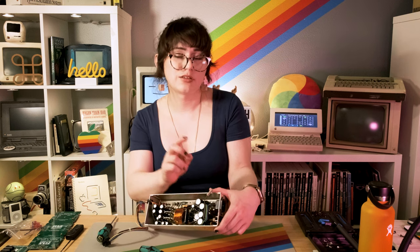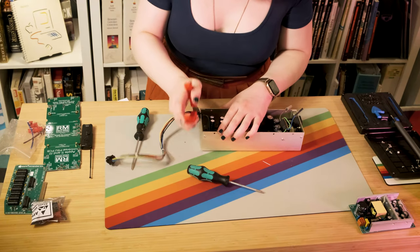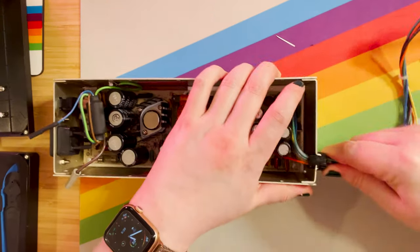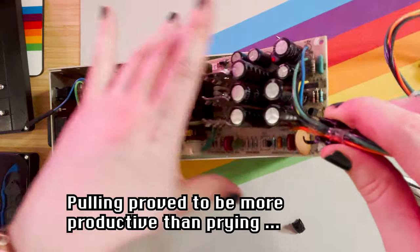In your case, if you don't have little connectors, you may have to do some cutting. I got lucky and I didn't have to cut. Let's take out the wire loom from the back so we can remove the whole power supply board. To remove this little grommet, get some pliers, turn it 90 degrees until you see a little door, then get your screwdriver and pry it open. There we go — now it's finally out.